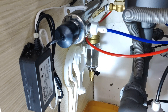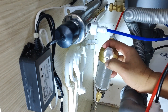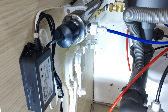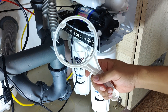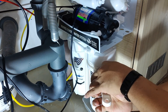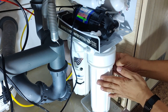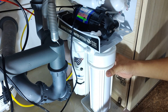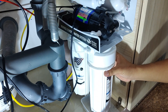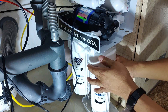My system has a washable pre-filter installed so I will start on this one. Carefully remove all old filters from the compartment. With the use of special spanners, slowly open the filter housings and double-check that the system has no residual pressure. Water overflow is to be expected, so use containers and towels to minimize spillage. Take precaution of the water pressure on your initial opening of the filter housing. Proceed only if there is no pressure and water overflowing has stopped.